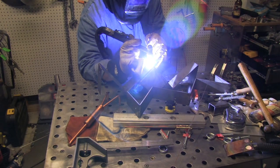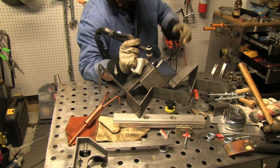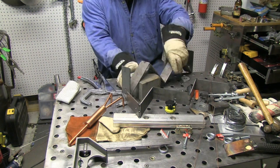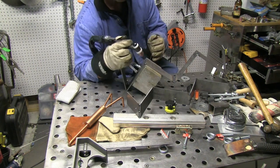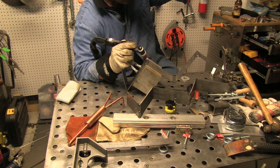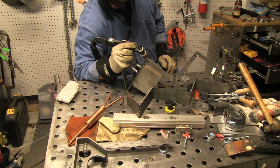This is probably about 90 amps — it doesn't take much to do an outside corner joint. It's probably one of the easier joints there is, and most common for building any kind of tank or bracket. It's just a very easy way to put a 90-degree L in something: butt it up corner to corner, put some backing behind it, and weld it.